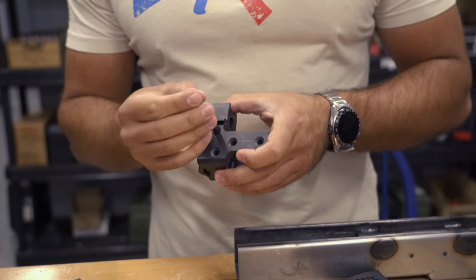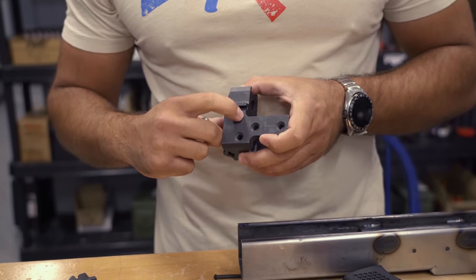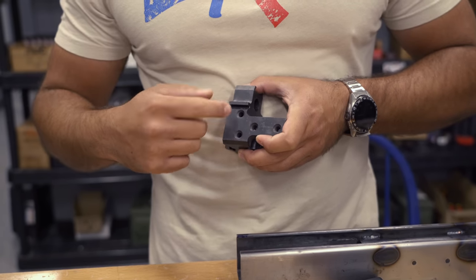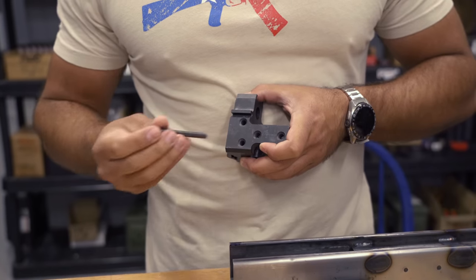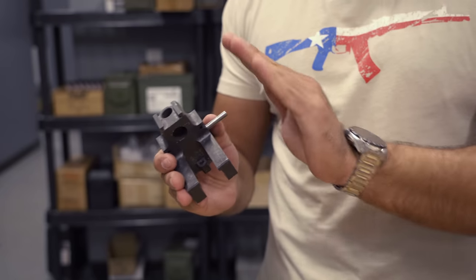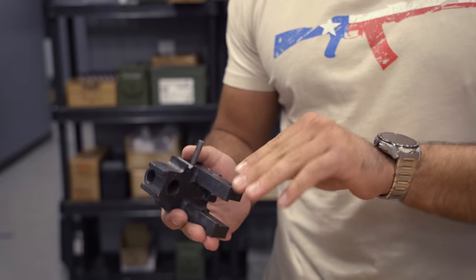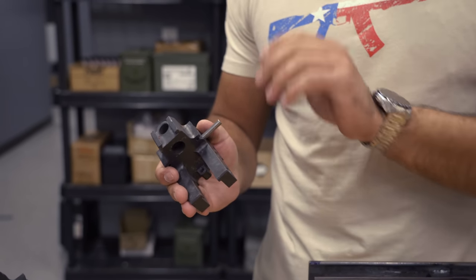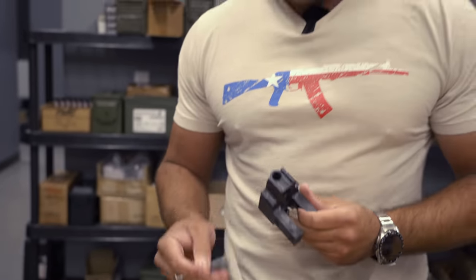These go in through here. And as you can see, all these rivets are countersunk for extra support, meaning the receiver is dimpled into those holes so it grabs the sheet metal even tighter, and it goes through the other side where it's cut to size and then smashed into the other countersunk and dimpled side of the receiver. So the rivet head is formed, and you have a big-ass rear trunnion that is not going anywhere.